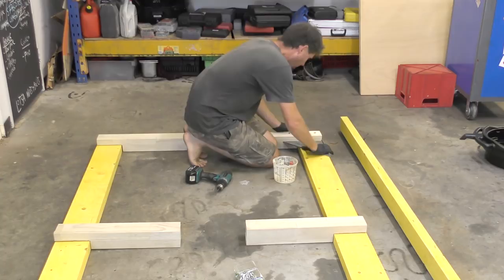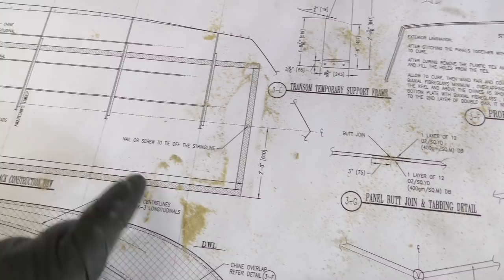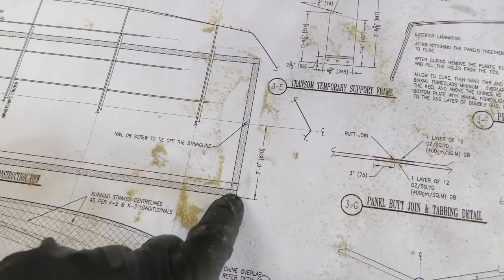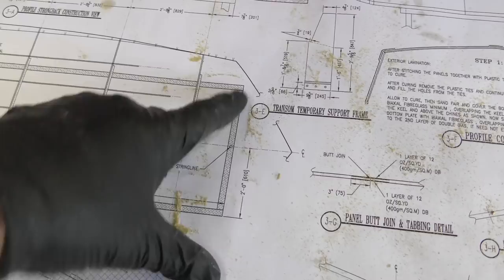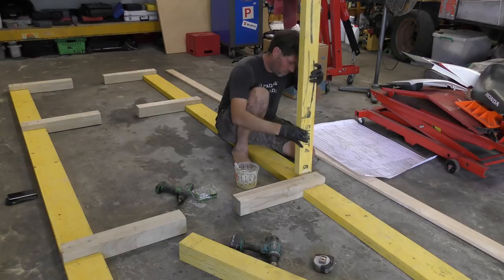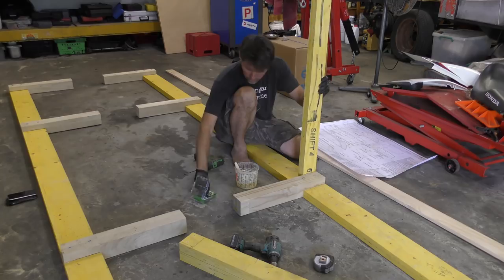What I've done now is cut and drilled four pieces that go across this way. The total distance from outside edge to outside edge is 610 millimetres, so 1,220 total. I've then taken away the 90 millimetres that accounts for the two longitudinal pieces to give us 1,130 millimetres for the cross pieces.